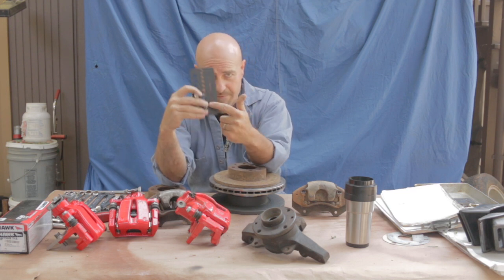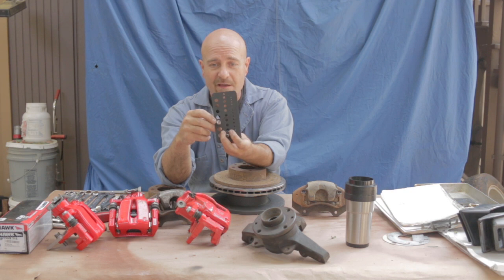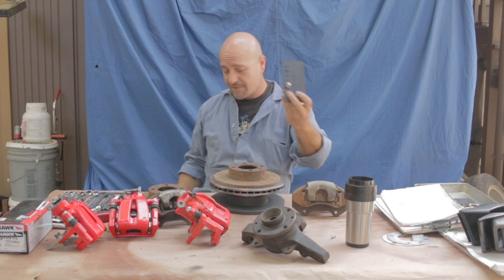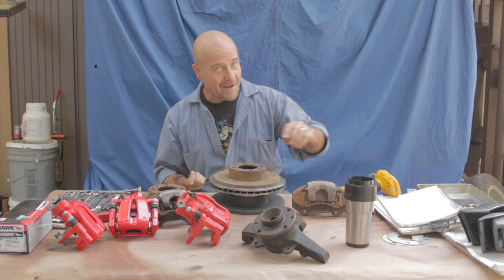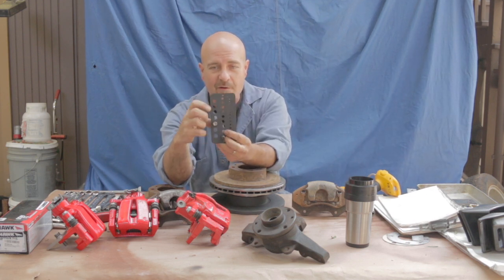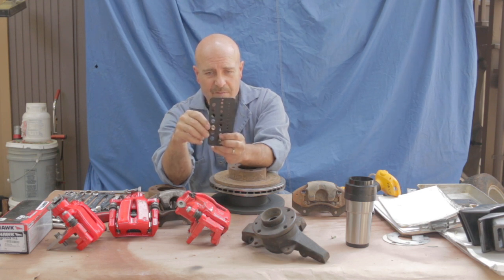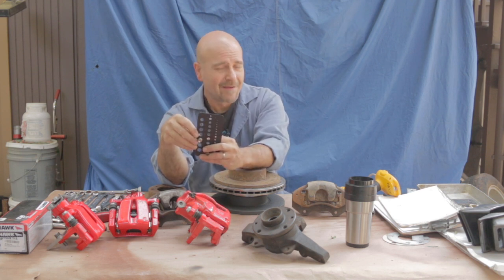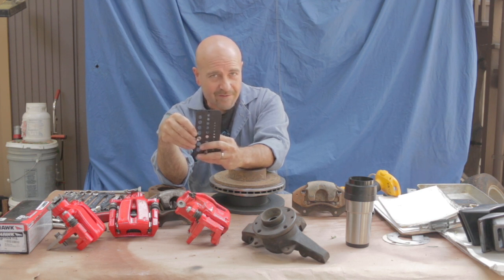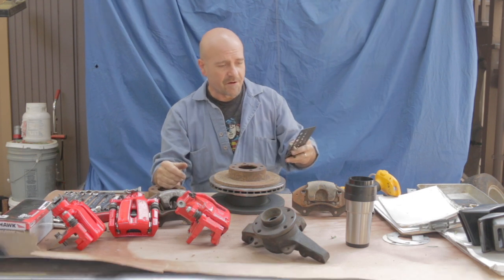This is just a drill bit gauge so you can find out what size drill bits you need. What I did was literally go up in 64th increments using five drill bits, using a standard DeWalt 18-volt drill with lots of cutting oil, slowly and carefully going up bit by bit until I arrived at the size I needed. One of the reasons why I did it in small steps is because it's a lot of steel to hand-drill sideways — trying to apply even pressure and maintain axiality going through the carrier without wobbling off axis. That was fun. I've only done one side.